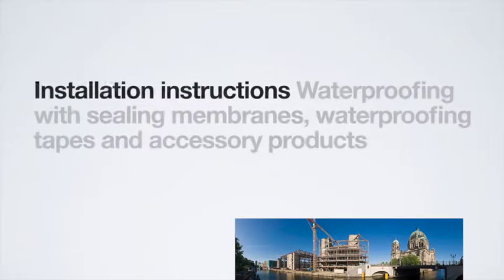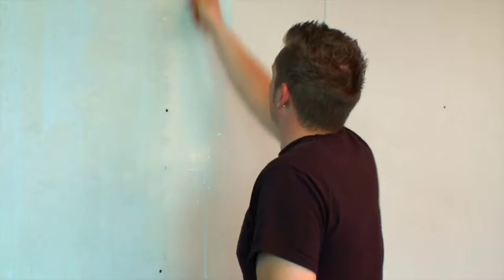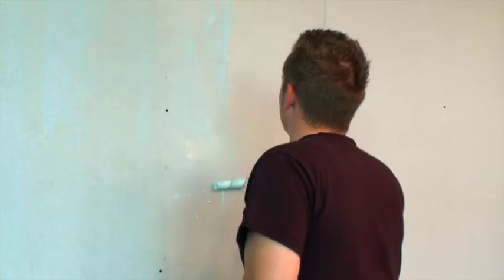The objective of this video is to assist you with the suggested installation of the sheet membrane system, including the sealing tapes, preformed corners, and wall and floor collars. First, the surface must be prepared. Remove all dirt and debris. It may be necessary to apply a primer.